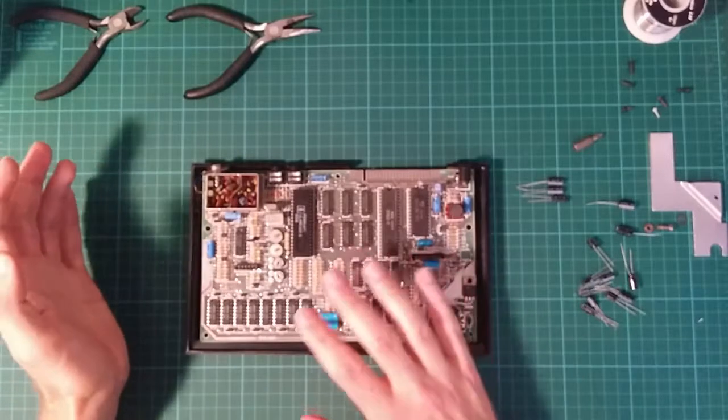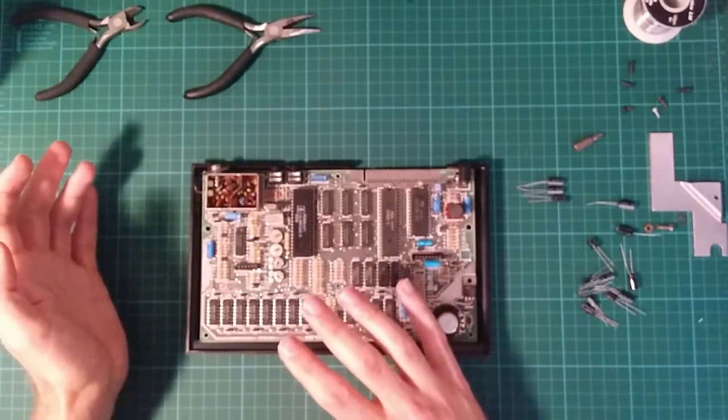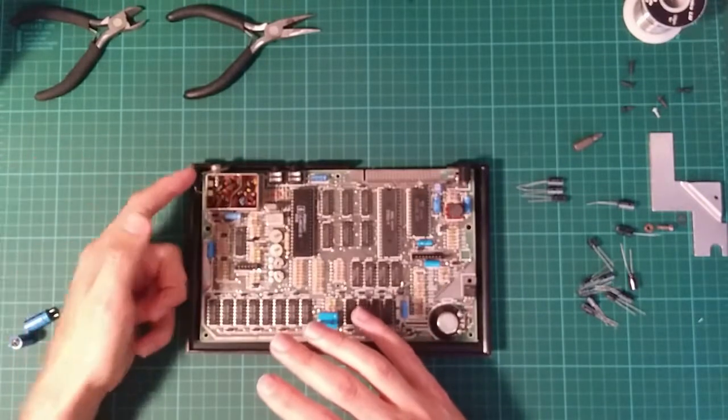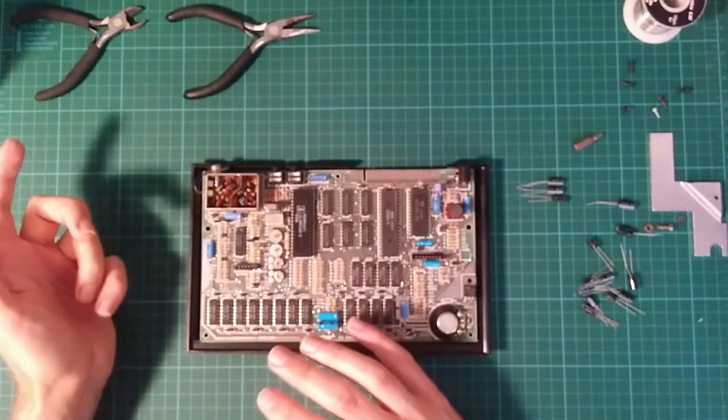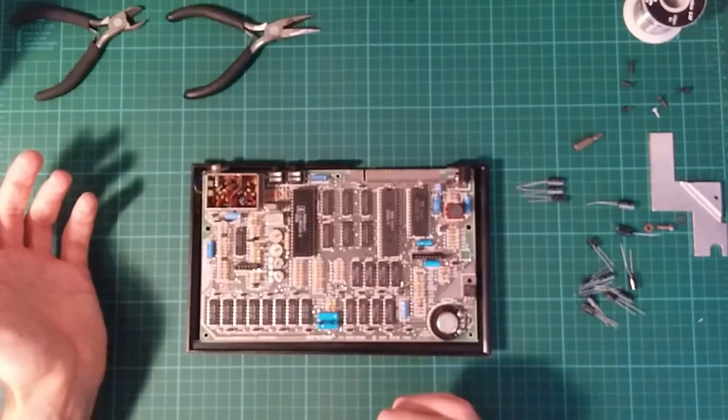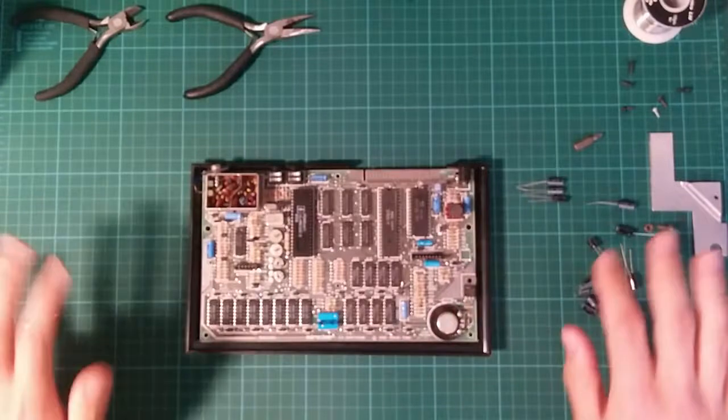The modification wasn't a particular success. The video signal's very bad. So there's also a change I want to make, which involves replacing this wire with a capacitor, which should hopefully improve it. I'm also hoping that the reason for the poor video signal is dodgy capacitors everywhere.